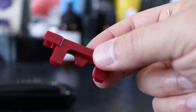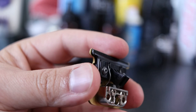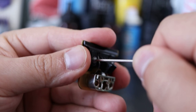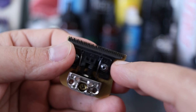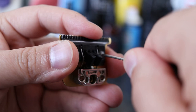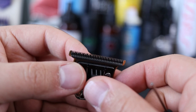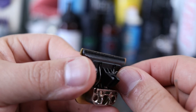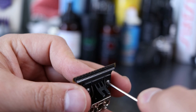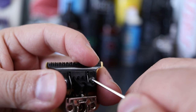I try to get the light to hit on an angle on these top gold teeth so I can see just the touch. You could grab a ring light — any kind of light as long as you can see a reflection. I go ahead and work on one side the same way I did with the blade setter, but manually with the blade off. I look at it, move it around — it's snug very minimally, so I can move it but it also won't move if I don't want it to. Work on one side, tighten it up, check the other side. I always check from different angles, then loosen the other side, check where it's at, move accordingly, and tighten it back up. Looking from every different angle to make sure it's nice and straight. We can actually put this side down a hair — and when I mean a hair, I mean like half the thickness of our freaking hair. Very little bit. Tighten it back up.